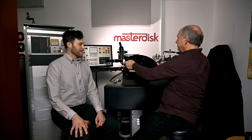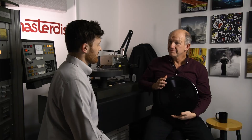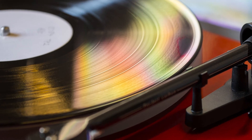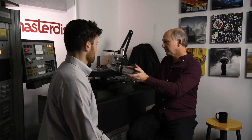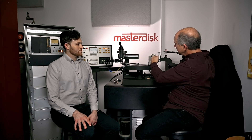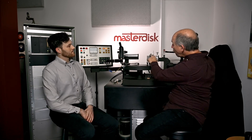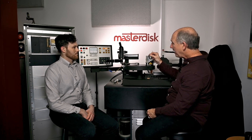Basically, how do you know where track two is? There's a little extra space. If you can't see it here we'll do a close-up — about halfway through this side there's a little space. On every record that has more than one track you'll see those little gaps, and people always wonder how they're made. It's very simple. The speed that the cutter head is moving across the disc is relatively slow while the music is playing, and then when we get to the end of the track we press a button on the remote called 'marker.' For basically about one revolution the cutter head speeds up for a second and then goes back to its normal pacing. That changes the image — changes the view of what it looks like on the disc.